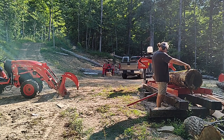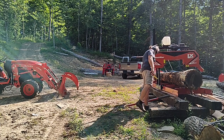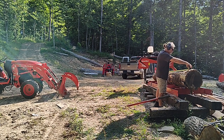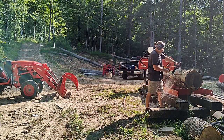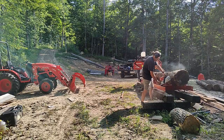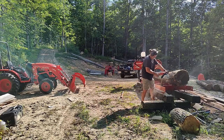The way I usually go about creating these posts: first, getting the log centered on the mill. I always like to have the flared end of the log at the back and the skinnier end at the front blade end of the sawmill — that may just be a preference. You also need to find the center of the log on both sides, because one side is flared and the other is skinnier, which is more pronounced on longer 12-foot logs, meaning it sits at an angle on the mill.